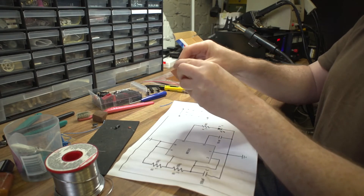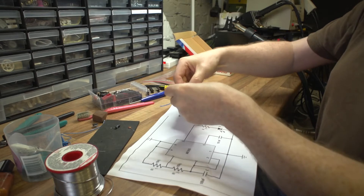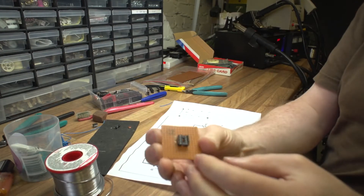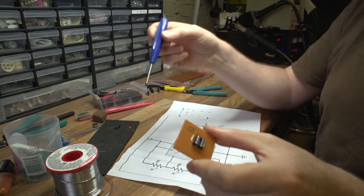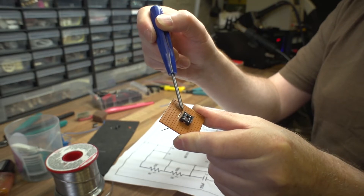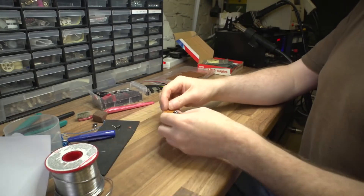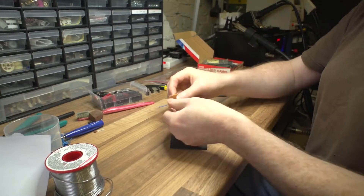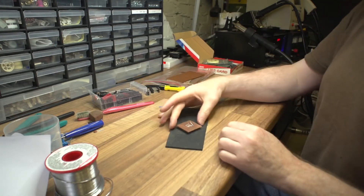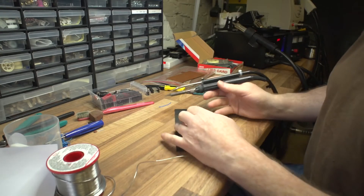After a while using Veroboard, if that feels complicated you kind of get used to it - you start to visualize where your links and tracks are going to go. So, pin four to pin eight. I can see I need a close-up lens. I've now got the wire link in here - that's the wire link there, so it's pin four coming through the wire link along the Veroboard, and it's going to come down to pin eight. When you put the wire through, just give it a little bend at the very end so the wire doesn't fall out, then solder it in place.